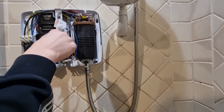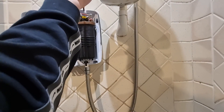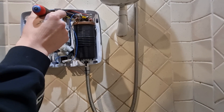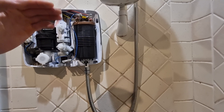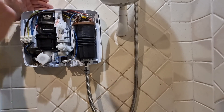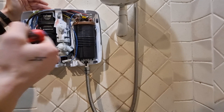There are also flow detector switches inside the shower, and this is what usually causes the problem if your shower is going hot-cold-hot-cold or not engaging at all. You have a little solenoid which engages and disengages the water flow into the heating element, and an over-temperature cutout up here. If the shower isn't detecting a high enough flow it won't engage the heating element, or it'll cut in and cut out. If you have a failed flow switch, the problem will typically be consistent no heat.